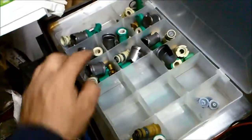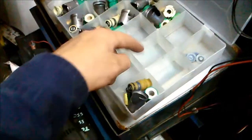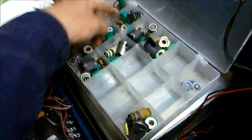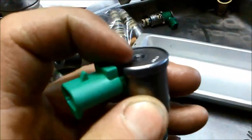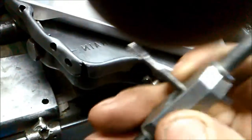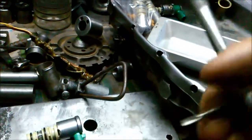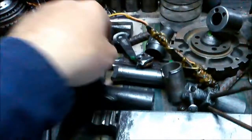All that's left is to put the rest of these together. We've got two trays there that need assembling — we've already done seven solenoids, and there's a whole other tray, so about 17 and another 25-odd solenoids to put back together. If the solenoid is over-adjusted — if you've gone too far with the adjustment — what we do is get a 5/32 with a fairly flat tap there and slowly wind it in, then as we're still winding in, we pull it out. You'll need to reset it with this tool, re-spread the thickness, put it back in and readjust it again.